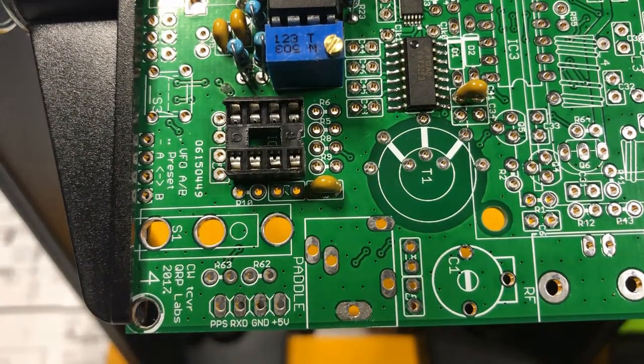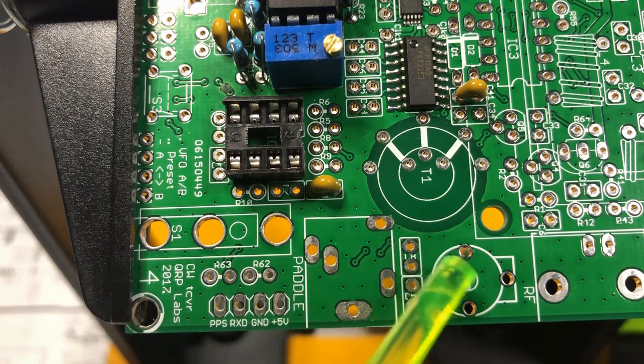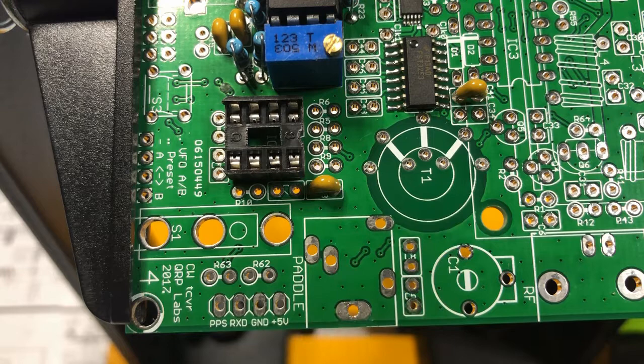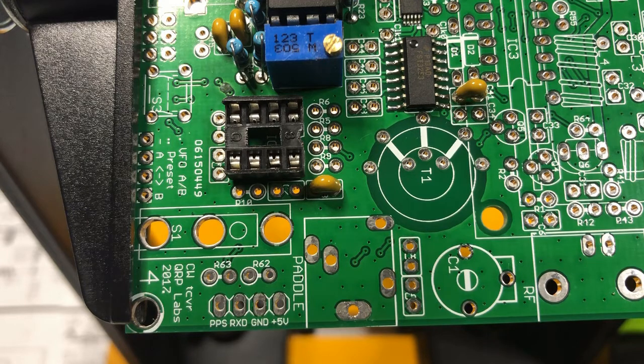One quick note: there is software in the kit that allows you to actually test the bandpass filter, which you adjust using the variable cap. You can encounter a situation where the cap plates are fully open or fully closed. In the case where the capacitor is fully closed, you have to add turns to the 30-turn secondary. In the case where the capacitor is fully open, you have to remove turns.